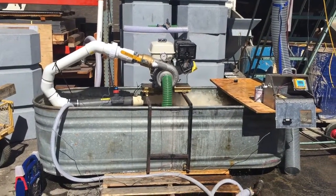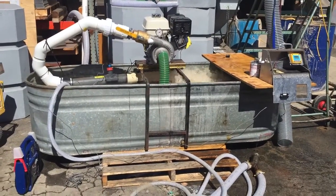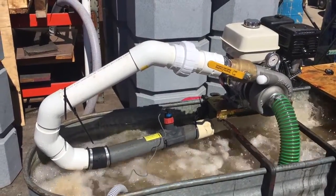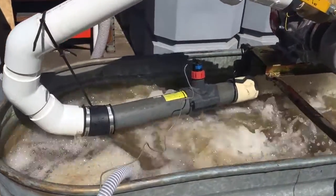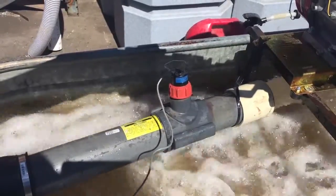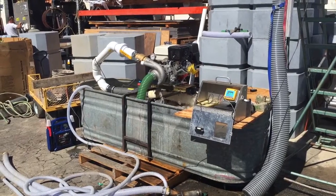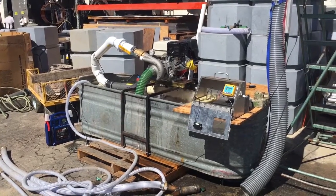You can see here we're doing some further testing on the pump for actual gallons per minute. We use two different methods: a meter that determines the exact GPM, and also an ultrasonic meter to determine the flow through the water and through the power jet. This is a close-up of the pinwheel meter we use — there's a small pinwheel mounted directly under that red knob on the 3-inch pipe. This shot gives you a better view of what roughly 400 gallons per minute looks like — it's a lot of flow and a lot of force. There are inefficiencies in that plumbing, but we're still doing quite a bit of GPM.